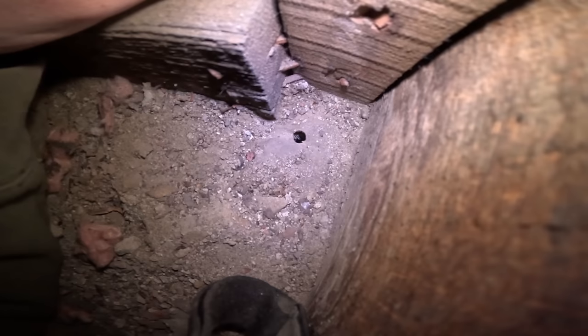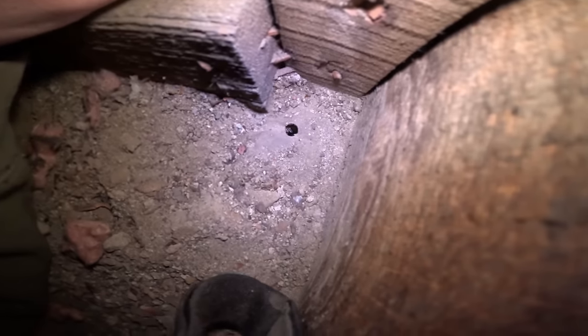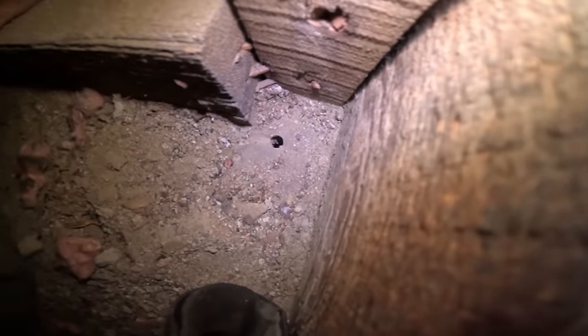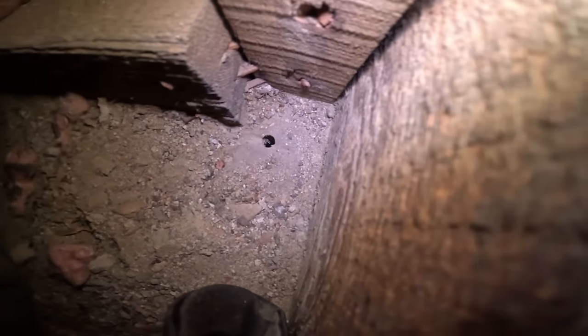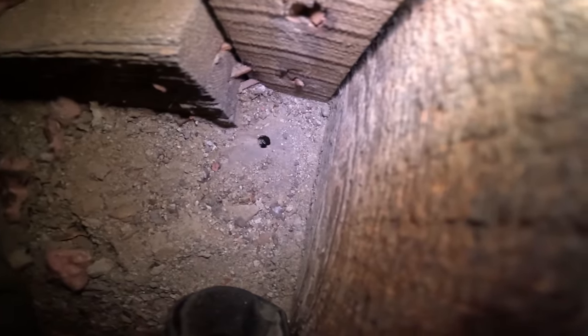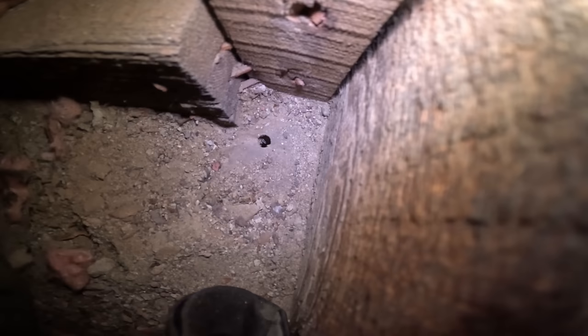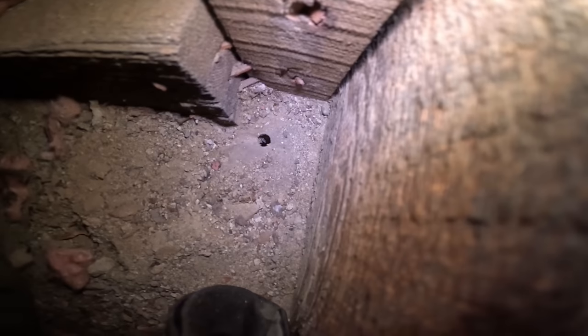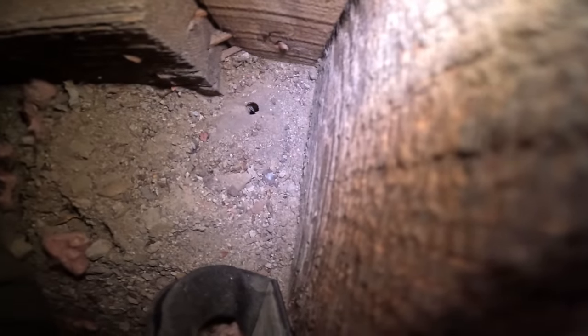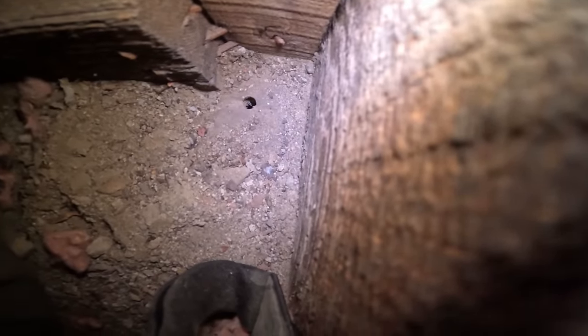Where that hole is, can you see the edge of the plaster up there or no? I can feel it with my hand if I reach down to the right into that bay. So what I was doing, I was trying to shove so much fish tape up that the loop of it pops out the top. Right by that hole somewhere, just have them always pop up. Okay. I mean, I was just ramming it into the wall, as many feet as that fit.